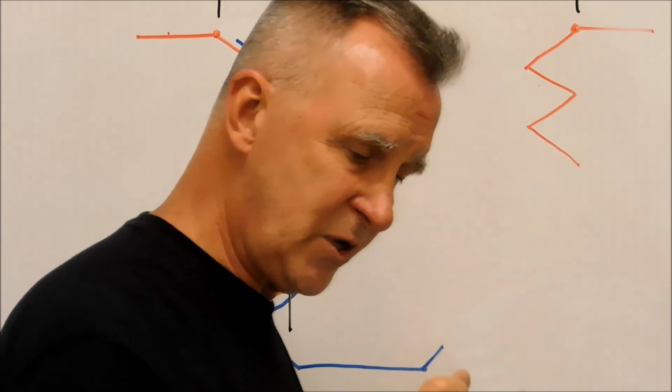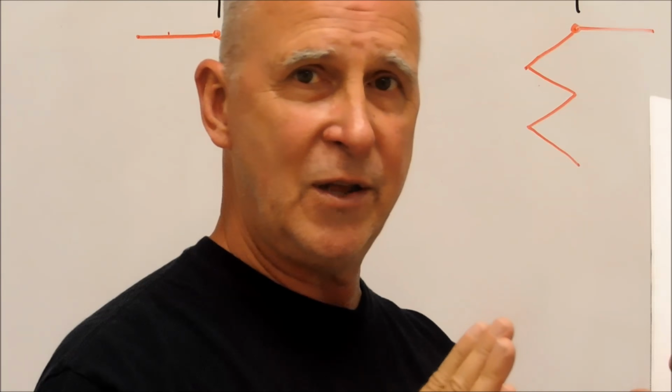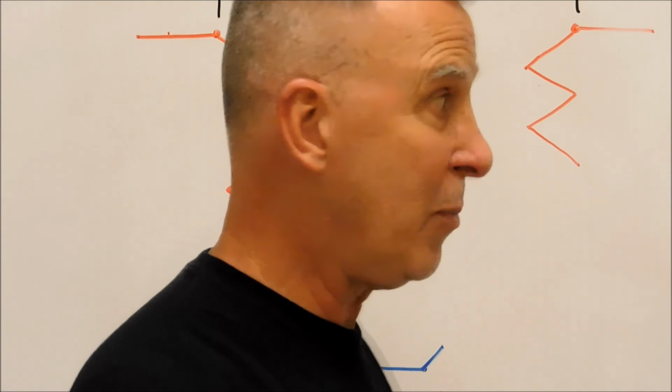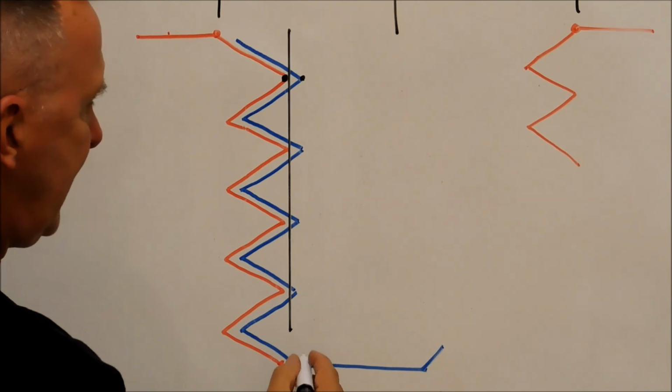When you're coming down through the center of a tap with an end mill, and you get through the bottom and the sides of the tap fall into the flutes of the end mill, it explodes. Now you need a wire EDM or a ram EDM because now you have a carbide end mill jammed down in your part. To do this safely, one of the dangers is the very last piece.